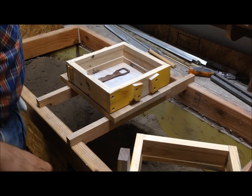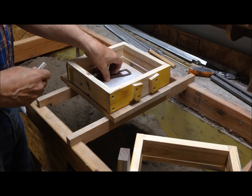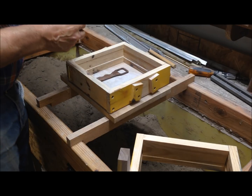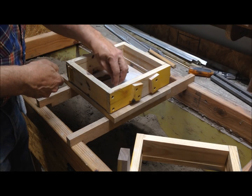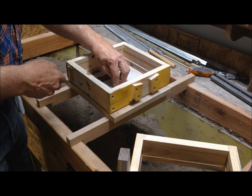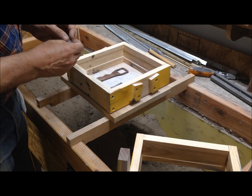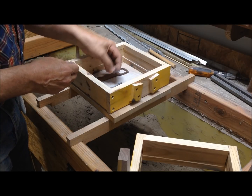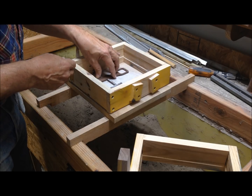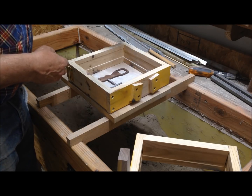Now let's see, I might as well use my little patterns that I made. Okay, this is going to go in the cope. So I'm going to feed over here close to the edge. And then we're going to put a runner. That's a runner. I'm going to put a gate. I think that'll all fit in there pretty good.